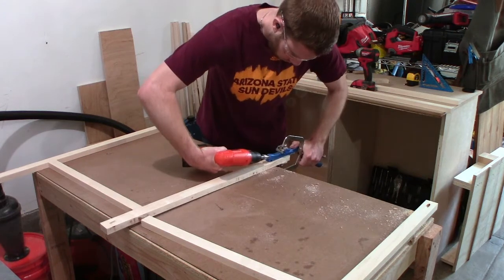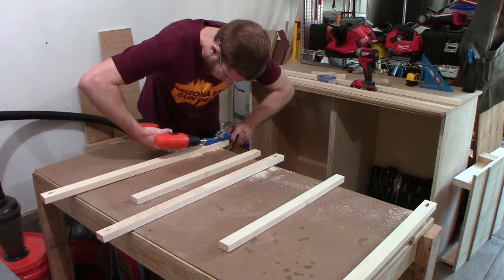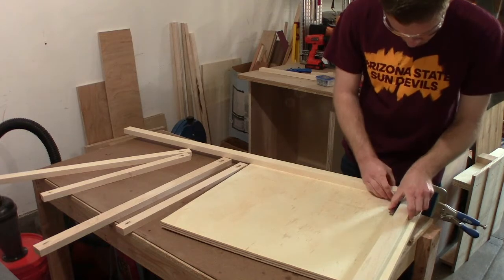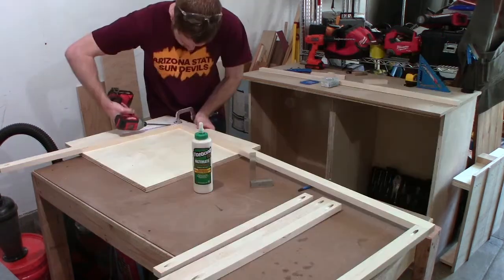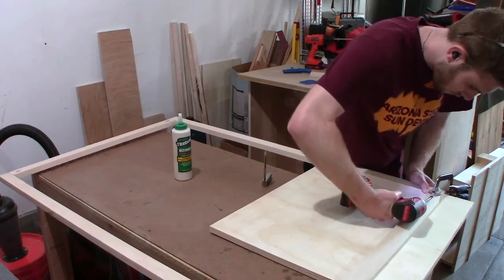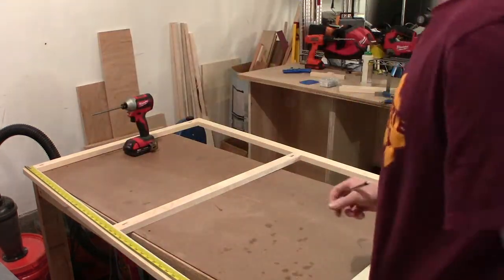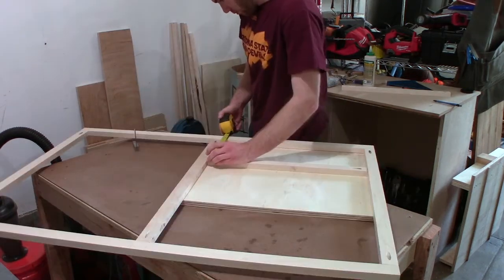For the face frame of the cabinet, I ended up going with hard maple, as I was looking for something more durable in terms of withstanding any bumps, nicks, or anything that could be thrown at it in a shop environment. To keep everything even, I clamped the pieces onto a scrap piece of plywood that I knew was straight, as my work table doesn't have a lip to grip onto. To set the center frame as well as the drawer frames, I measured and drew the center lines for each piece, then lined them up, added glue, clamped them in place, and screwed them together.